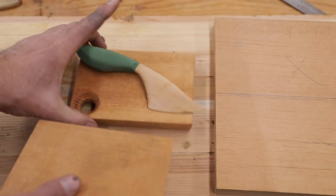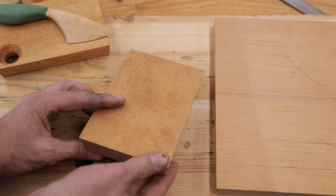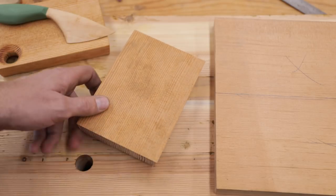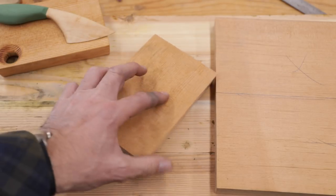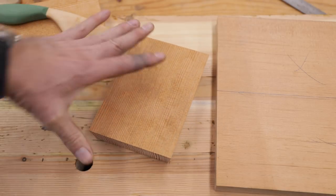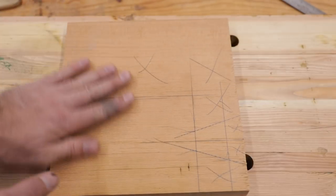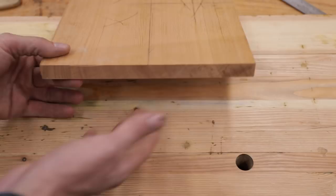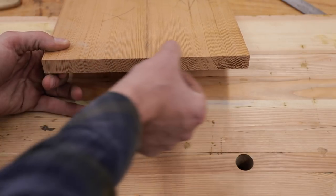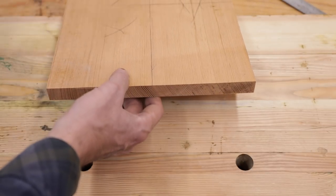One cheap way to find this thickness is stair treads. If you go to your big box store they'll have pre-cut stair treads that are bull-nosed and typically this thickness — it's kind of an unusual size you don't see all the time, and that's what makes it a little more special. If you can't find that, you can go with a clear three-quarter inch — just a standard CVG clear vertical grain, which makes a nice breadboard too.